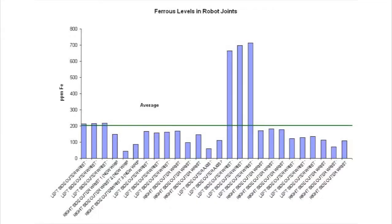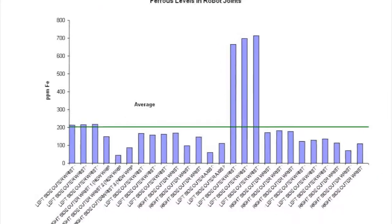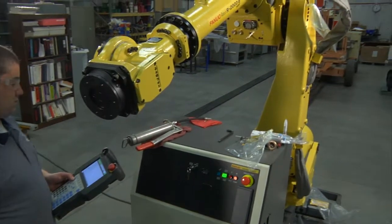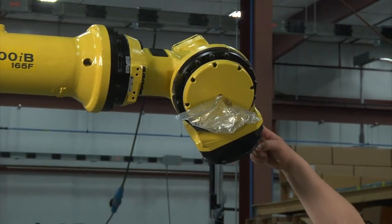This graph shows the kind of information available just by running a simple wear test on a set of 30 samples from FANUC model 2000 harmonic drives. Three outliers in this group are immediately apparent and provide a clear differentiation that will allow a prioritized strategy of inspection and maintenance that will minimize downtime and reduce the chance of unexpected failures.